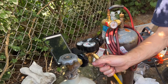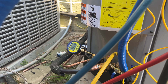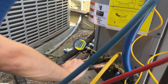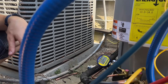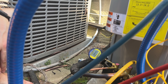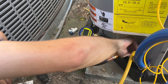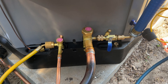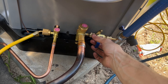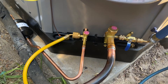Breaking the vacuum now. It's pretty close to empty but slowly breaking because it's going through the TXV. Once it reads positive pressure, I'll remove it and let the nitrogen flow through. I was having issues going from the low side so I decided to go in from the high side, purged for a bit, let the pressure drop off, and now I'll put the vacuum gauge back on and go again.